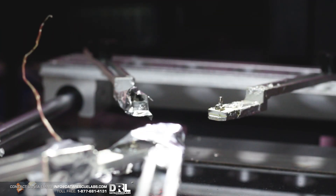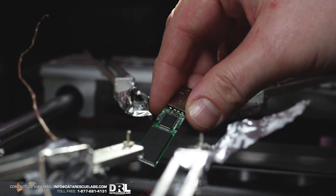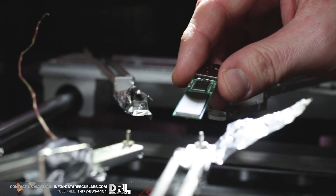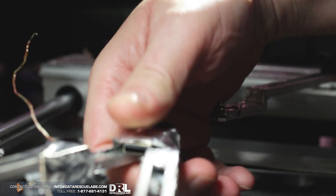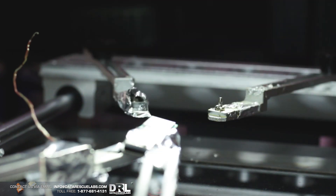Let's mount this flash drive in here. This flash drive is double-sided, so what we're actually going to do is heat it up from top and bottom, and that will release the chips on both sides. The best way to mount it, that I find, is doing it this way. I also have a bottom heater, just a preheater itself, which I sometimes use but not always.